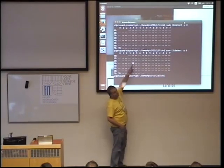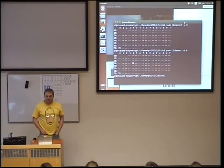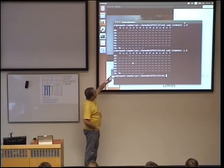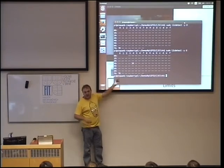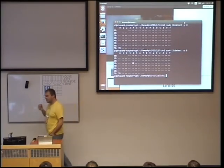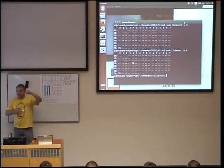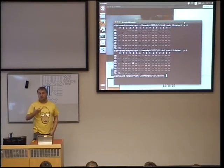So we have 34, it's another. You can have up to 128 devices on this serial bus, or this simple bus. And you just access those devices, you call the address, and then you write some information to that address or read. A typical I2C device behaves very similar to memory. So you have memory cells, you write information to the cells, or you read the information from different cells. So the system is very easy to understand and very easy to use.